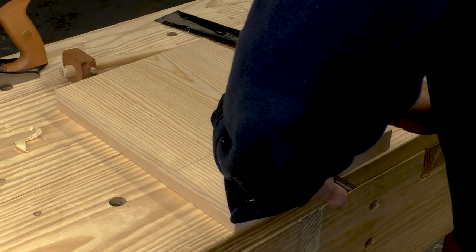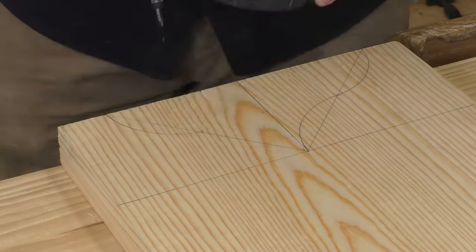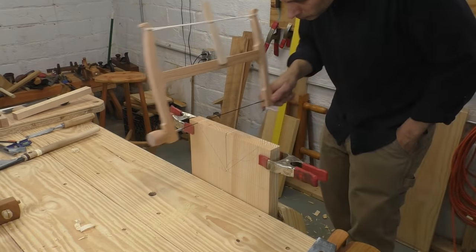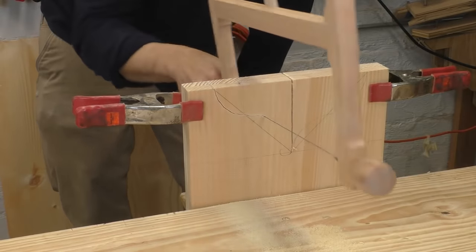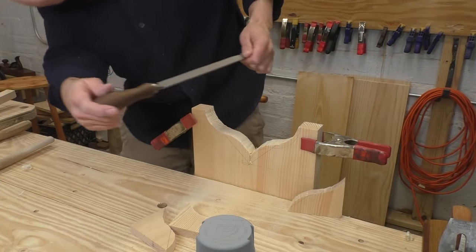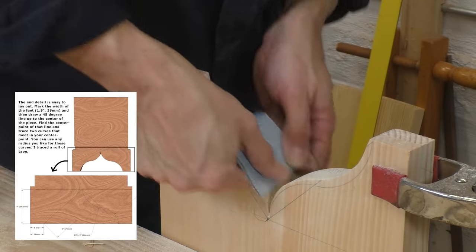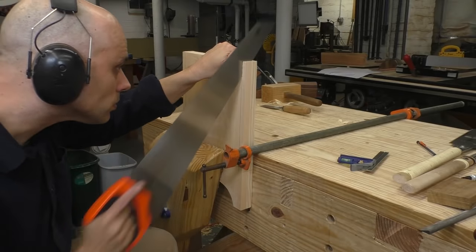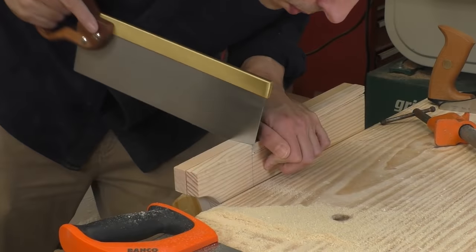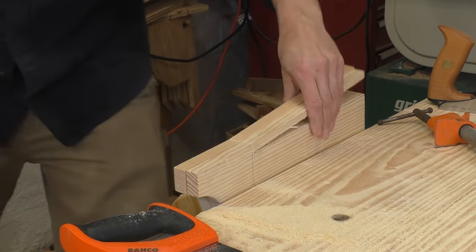That foot detail looks difficult, but you don't even need a compass to lay it out. This is a classic shape called a Roman Ogee — it's just a pair of curves laid out along a line. I'll put the details in the plans. I like my shop-made turning saw for this kind of work, but a coping saw would work too. There are tons of decorative options for these feet, and you can just look around the internet for ideas. If you can saw close to your line, there's just a little bit of cleanup to get smooth, fair curves. The notches are easy to cut, especially if you get down on one knee to give that saw a shallow angle to track the line. We rabbeted the front and back first, because the depth of that rabbet tells us how deep these notches need to be.